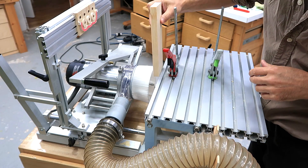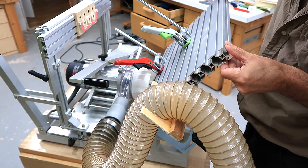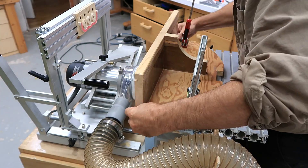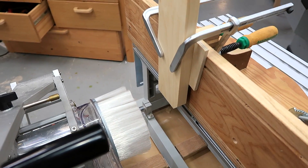I need a piece in place like this to cut the end of it, and this table tilts to vertical for that but then I can't use these clamps anymore. So I prefer to use this right angle jig so I can clamp it from the back. With these bar clamps on the back there's not much sticking out to hit the router itself.